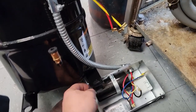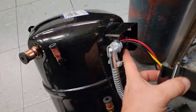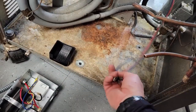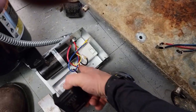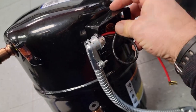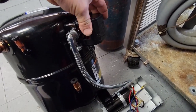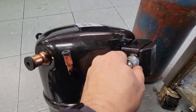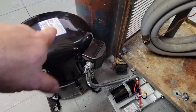We're going to have to trim that plastic out for it to fit in there, because that's not going to fit and there's nothing underneath for it to plug into. We'll trim that out just a touch, hook these up, and run L1 and L2 over here to connect to the common — that should be the run. Connect to the capacitor, got her all wound up so she isn't getting into anything. Used the Milwaukee tool to trim that out so it fits right in there.